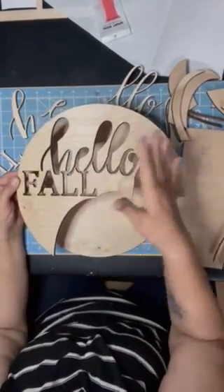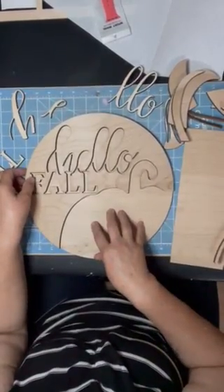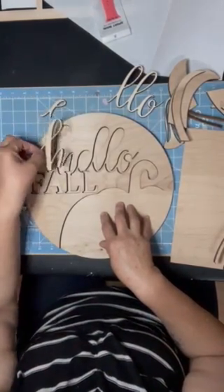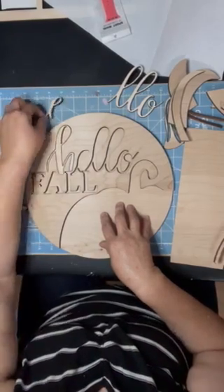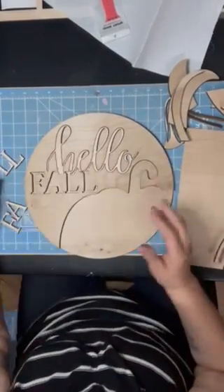I'm going to send this with it — a lot of them will get it — but this is what you're going to get on this one. What you would do is you would line this up on your wood after it's been painted or stained. And then after your letters have been painted and stained, you'll glue them and then you would drop them down in your template like so. And then you don't have to have any guesswork as to whether it's straight or not, because this is how it's laid out.